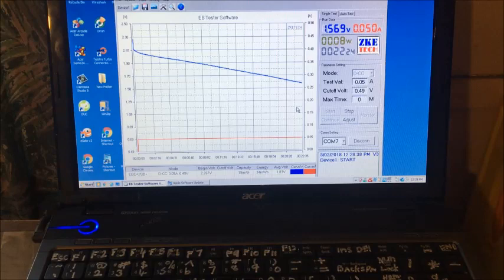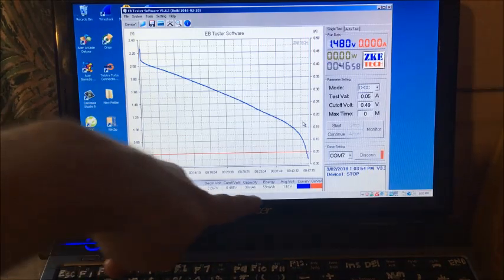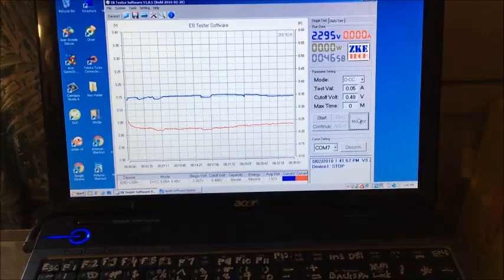Alright, I'll update later. Load test number 8 has finished. We didn't quite get our 60. We're only 59 milliwatt hours. And bounce back is 1.4. It ran for 47 minutes. We're 3 minutes shy of the 50 minutes. I'll do another charge and see if that improves. Could be on the slight decline maybe. Charge curve number 9. 35 minutes, sort of went over the time.